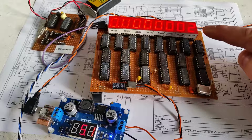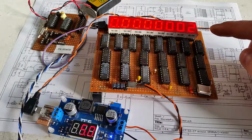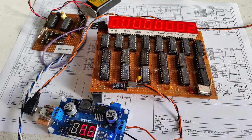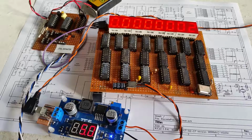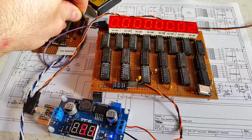And that's a really good figure to get out first of all as the 8 megahertz one, because that shows that it will count down to even the least significant figure. So its precision is guaranteed to be 100 nanoseconds plus possibly another 100 nanoseconds depending on what stage it starts counting. So next I'll move the divider onto dividing by 2.